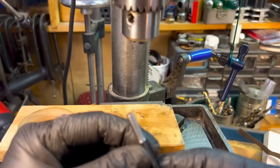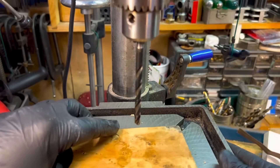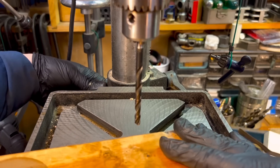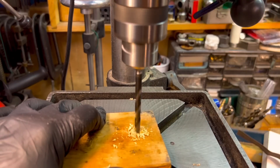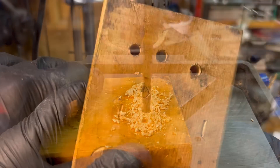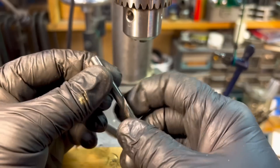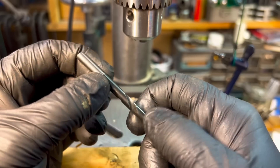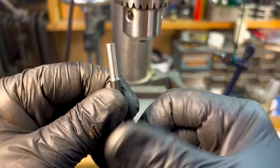Here you can see how nicely that came out. I did try to keep the quarter-inch size marking on here so I know what size it is, but I reduced the shank. Now this is running true — if you try this on a belt sander you'll probably get some wobble. We'll chuck it into the drill press and just drill a cup just to see how it works. You can see nice, clean holes. No reason to chuck these bits just because the end gets a little chewed up. They don't do this in machine shops because they don't have time, although the old-fashioned machinist always used to redress the tips or backs of bits if they got chewed up — they would never throw anything away until it was useless. But today they just chuck them. So these are always savable when you chew up the back of the bits.